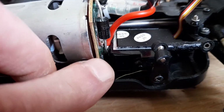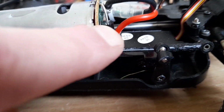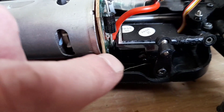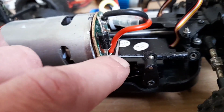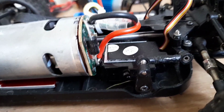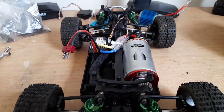So this bottom pin on the motor sticks out, so I had to desolder that, bend the pin upright, and then you can just fit the servo in. When you're fitting the servo in, I've had to cut the top of the servo mount off, so it's only got the one side that screws in, but obviously double-sided sticky tape on there and it holds it down absolutely fine. So that's the transplant over with.